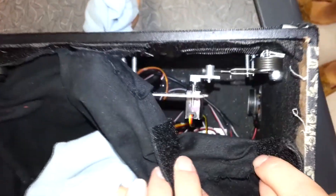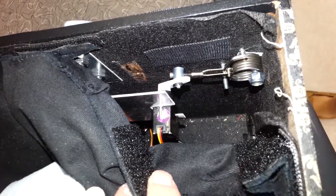The torsion springs are used to ensure the lid of the box pops open when released. A wood block was attached to the lid and cut at an angle for the springs to push against. The latch assembly also uses a torsion spring as a hook, which clasps an eyelet mounted in the top of the box. The latch releases when a servo arm pulls back on the torsion spring, freeing the eyelet and allowing the lid to spring open.